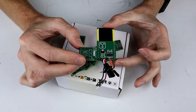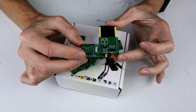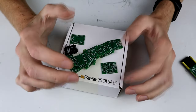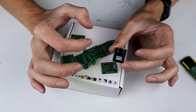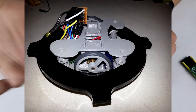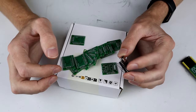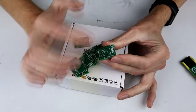These are the same SMD components I had in the last version, because they work very, very well. Having these components on this PCB just makes life so much easier. Back when I first started combat robots, you couldn't just order PCBs online — I had to make stuff with individual components: an Arduino, an H-Bridge module, a voltage regulator module, all wired together. It was so bulky and messy. I ended up with a robot with an H-Bridge sticking out the top that actually lost a fight by being hit on the H-Bridge, causing a power short.